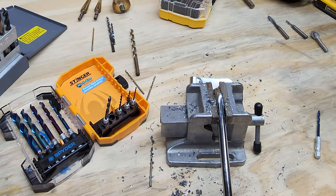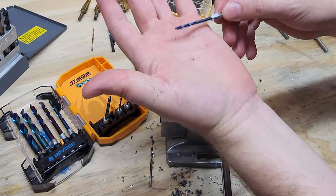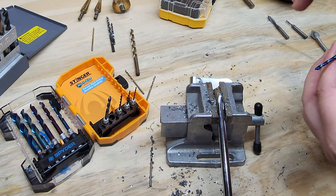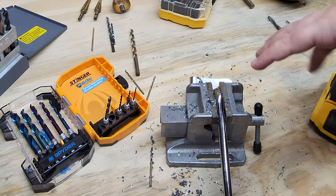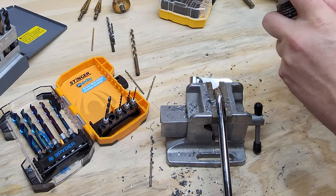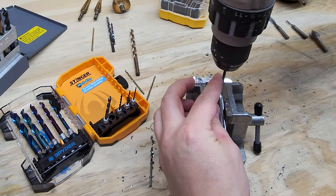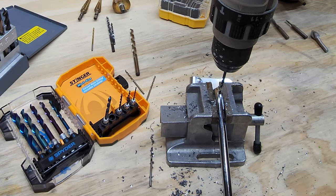As I said before, we're going to center punch first. We're going to use a 1/8-inch drill bit — a very popular size and one of the most popular for people to snap off in their index. Let's lube up the bit and center it on the curved surface. This is probably a harder steel than that tab I just drilled, so this should be very interesting.